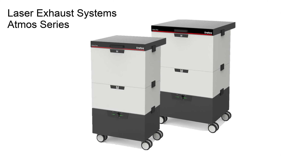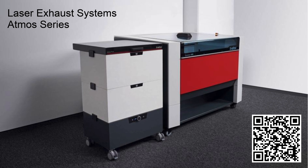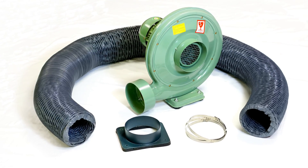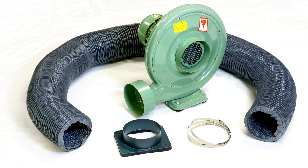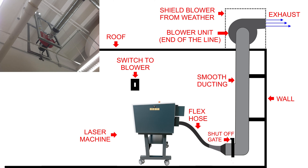There are two choices for an exhaust system. A closed laser exhaust system using a filtration system like the Trotec Atmos Pure filter systems — scan this QR code or see the link below for information on these filter units. Depending on local laws, the other option is an external blower system designed to ventilate a laser to the outdoors. This kind of system will require many components to be purchased. Always ensure the exhaust blower unit is at the end of the line for safety and noise. The further the distance the air must go, the size of the ducting and the size of the laser machine will determine the requirements. See the links below for detailed information on creating an external exhaust system, including links to most of the necessary components.